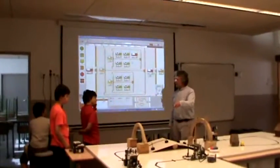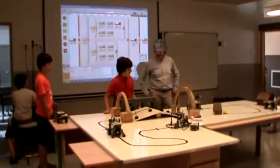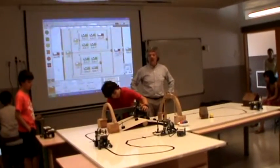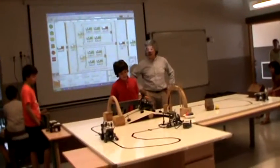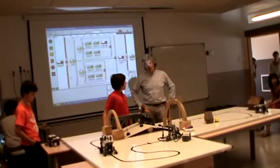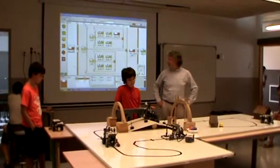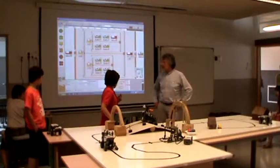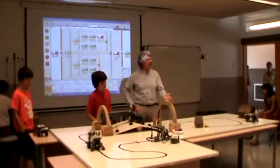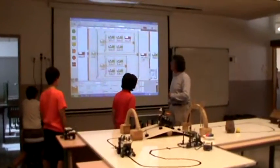Okay. So, what happens here when the robot is on top of the bridge? The light sensor is very high in relation to the ground, right? Then it doesn't detect anything. No, it detects something. It always detects something. It detects with the two sensors a black line. Yeah, it detects like if it was a black line. Actually, if there is nothing underneath, it's like if there were black, right? So what do you do to solve this problem? What do we do?